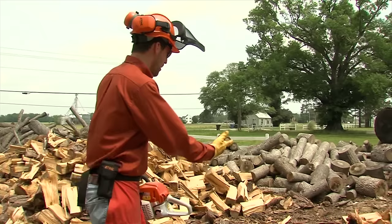This is also a good time to check your air filter - clean it according to the instructions in the manual or replace it if necessary. Also inspect your starter rope for wear. Replace the bar and chain and tighten it as we discussed earlier. We've cleaned up our chainsaw, checked it over, and sharpened the chain - we can now put it away. If you're going to be storing your chainsaw for a period of time, you'll want to loosen the chain before you store it and remove the fuel. Stihl has a video on their YouTube channel named How to Store Your Gas Powered Equipment that goes into much more detail. I'm Louie Casarello and I'm Jen Haar. We'll see you next time.